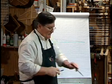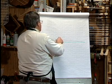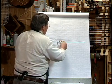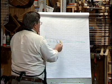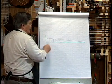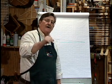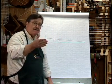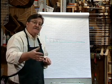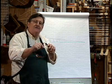Using a sharp pencil will definitely help. If you had to measure out the frets, this is a very interesting way of doing it because you only have to worry about the measurement once. After marking out all the frets, you cut this out, tape this portion to the fretboard you're going to use, put the individual marks on the fretboard, and from there it's just a matter of sawing the slot for the fret. This is called the tangent line method, and we'll now go on to some tools we can use in lieu of the tangent line or measuring out the location for each individual fret.